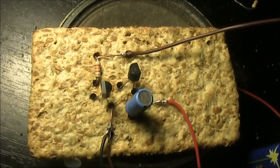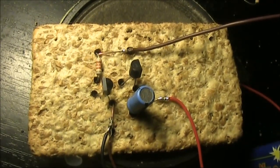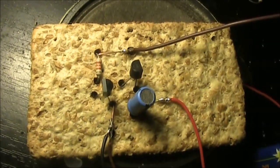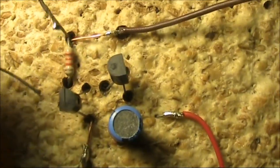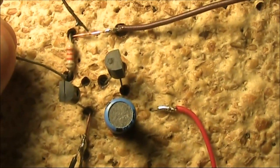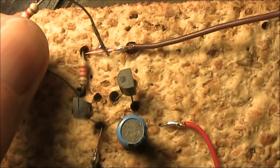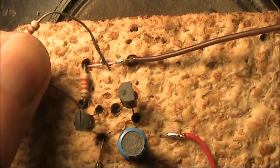If I wanted to make the ticking more frequent, to give a continuous tone, then I'd adjust either the resistor or capacitor values. I've just got here a 3.9K resistor — I'll just put it in parallel with the 33K. And the pitch increases.